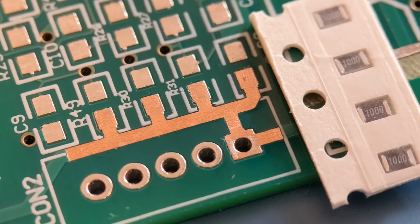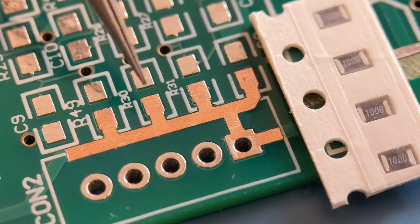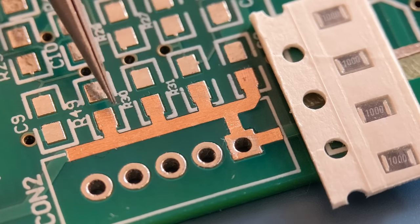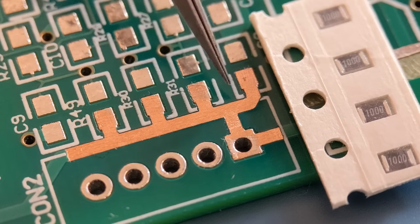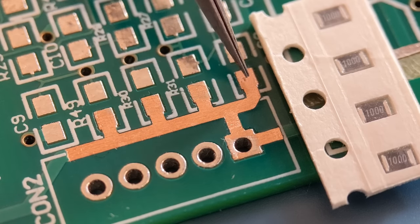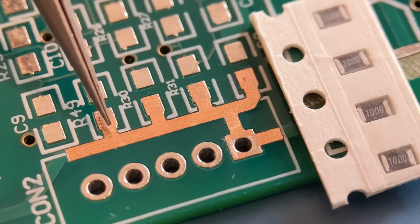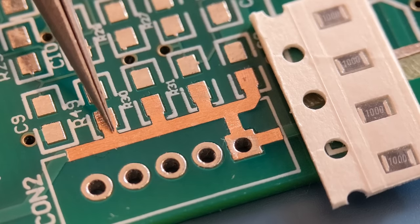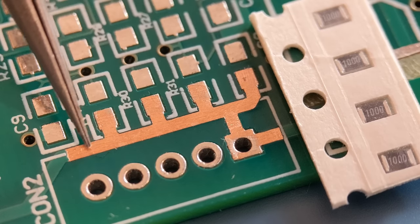Moving on to the first demonstration, showing this great simple Kapton Tape trick. For this demo, I've deliberately scraped away the resist across this track. I've got four resistors down these points. I'm going to put Kapton Tape across this point here so you'll get a proper nice resistor joint on these three. With this one, I'm going to leave the Kapton away from it.